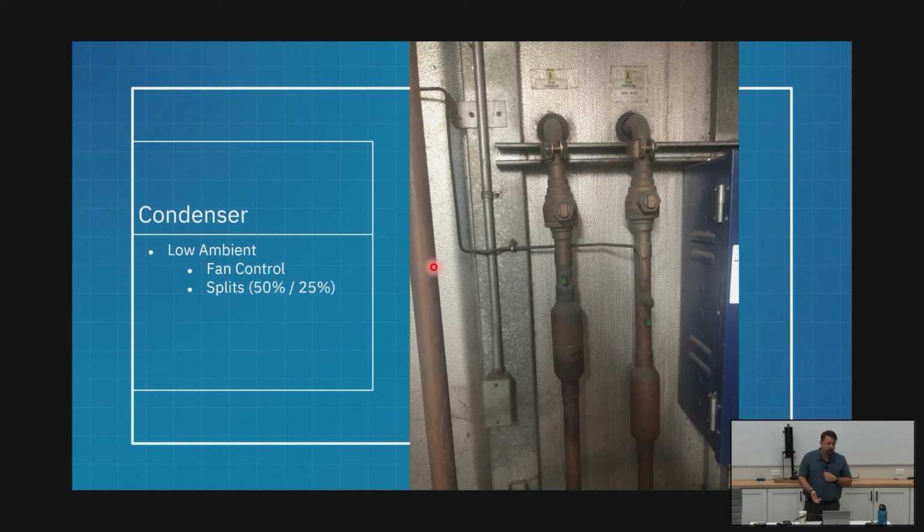All right, and we call this a bleed because what we're going to do is bleed that liquid refrigerant very slowly out of that half we've turned off. We're going to meter that into my suction. That's lost horsepower. All right, that's the refrigeration cycle. I went through the whole cycle, made a bunch of liquid, and I'm not doing any work with it. I'm just sending it back into the suction, making an expansion of what's in your head.